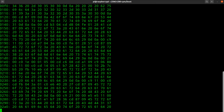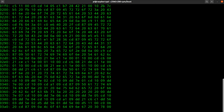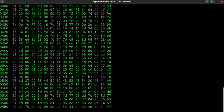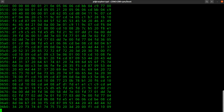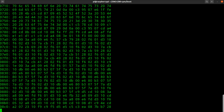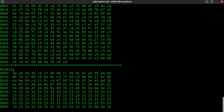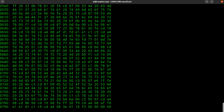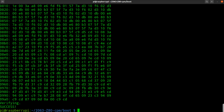Now I upgraded the software on my Raspberry Pi. I think I did that a couple of videos ago. And when you do that, they like to destroy all of your local custom settings, one of which is making the I2C go faster, and by default, it's agonizingly slow. I have yet to go back in there and fix it, but we can get over it. This is really a problem when you're doing a high iteration edit, compile, run loop, and you're constantly programming the flash. You would like it to go faster. But once in a while, once every 6 to 8 months, I can live with it.